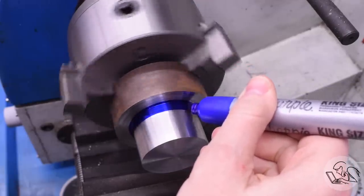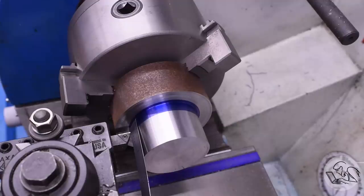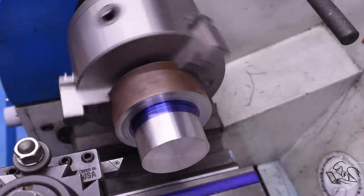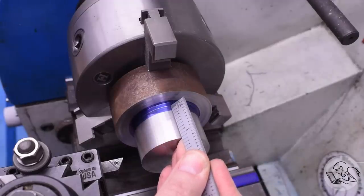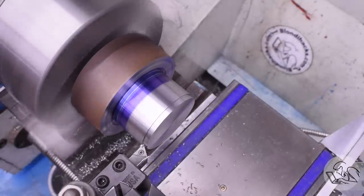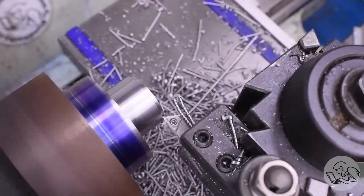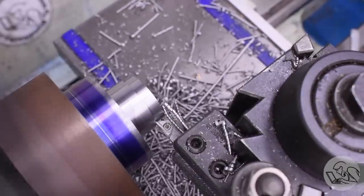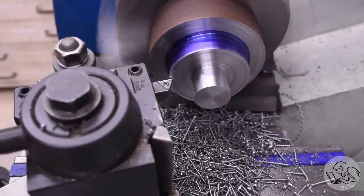Next I'm going to mark off a little area here at the base for the band saw because I know for a fact I'm going to be parting this off with the band saw and not the parting blade. This is pretty thick heavy material and I don't have a lot of room around that shoulder for my parting blade, so I'm going to put a little witness mark there — that's my 'don't go past here because room for saw blade' area. Now, there are two different orientations for doing this part. One could do it with the little hat part sticking out away from the chuck or the other way around. Doing it the other way would give access to the underside in one setup, but you'd need a lot of heavy grooving operations. I don't have a grooving tool that would be up to that, so I'm doing it this way, which means I'm going to need an extra setup.